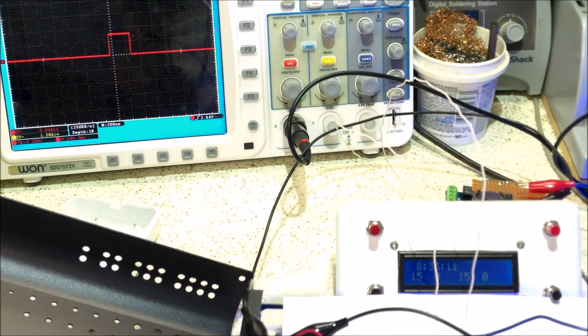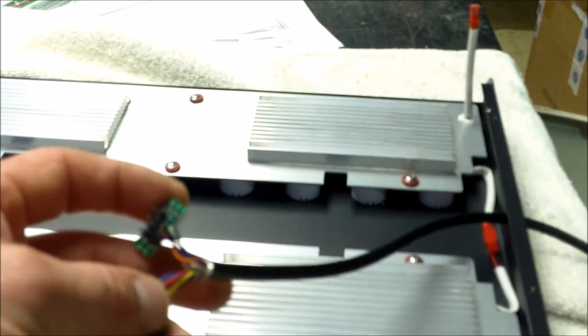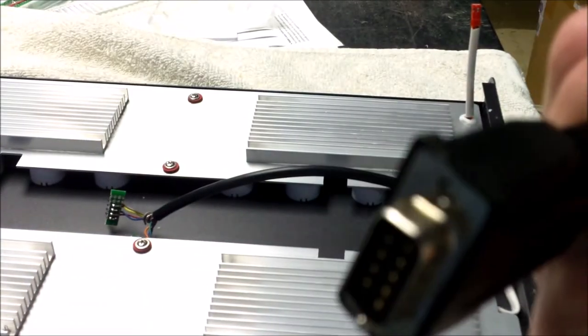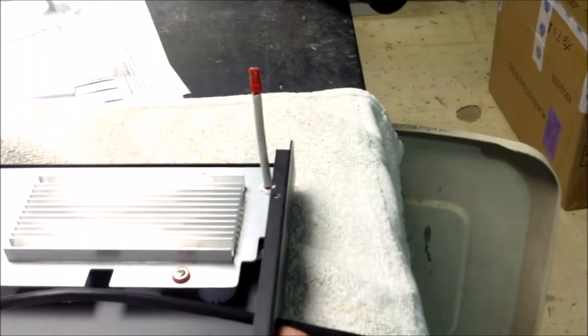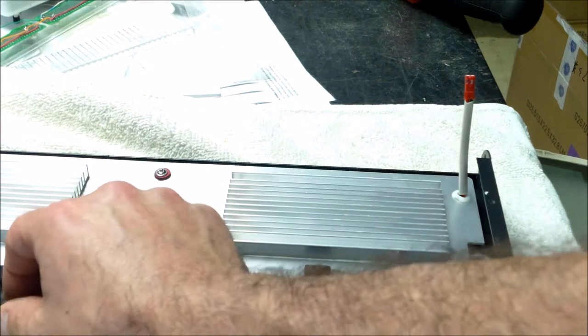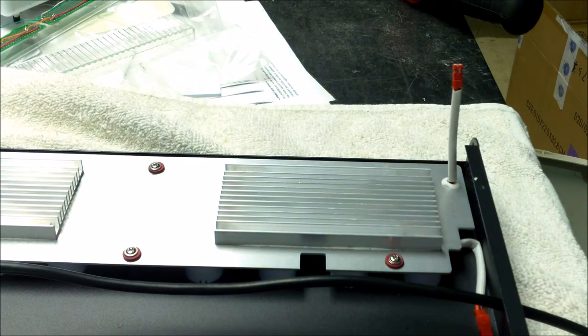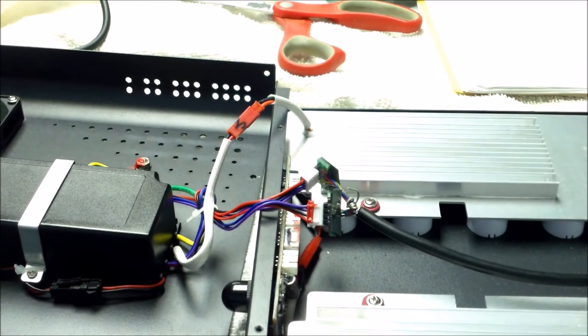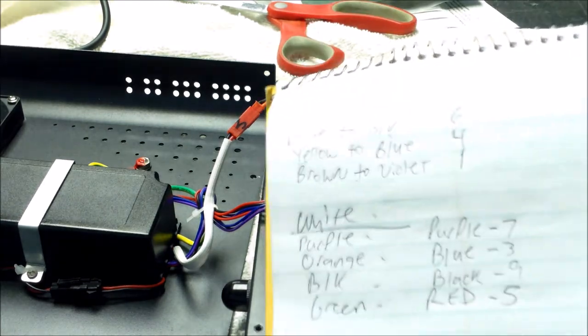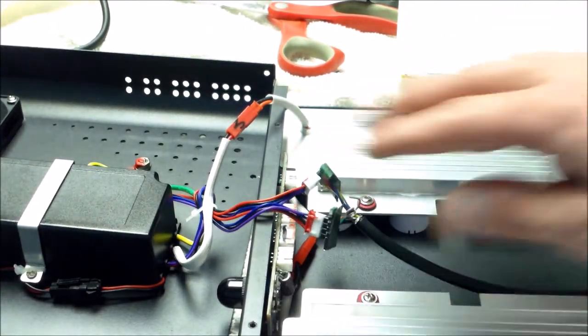That's just an update — I'll come back when I get the rest of it buttoned together. Moving right along, what I did was use two small connector blocks with four header pins in each with different color wires, running down to a serial cord. I put a small hole at the end of the unit to run the wire through, and this will connect over to the board. I'll put a little zip tie in here to hold that cable back, then set the top half back on. I have the connectors on, my wiring diagram with the serial pin numbers and colors, put a little bit of protection so they don't short out, and now I can fold the case back together.